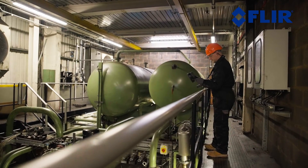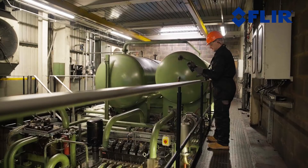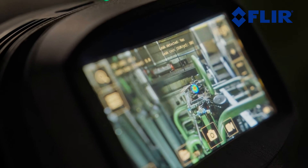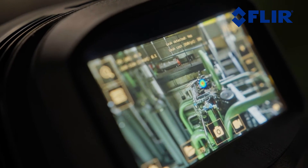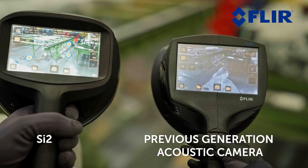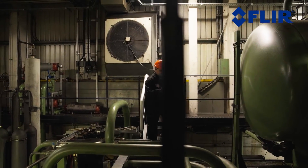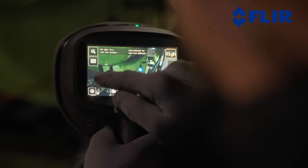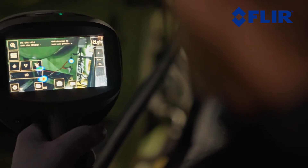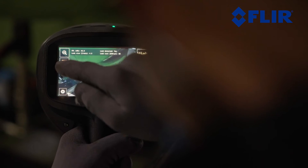You can use the multi-source mode to scan a large area quickly and find several potential leaks. In order to inspect the leaks more closely, switch to single source mode for a detailed inspection of each leak. With the SI2's enhanced multi-source mode, you will be able to detect more sound sources than ever before, including critical issues that would otherwise remain hidden. Note that when using multi-source mode, the device and the thermal studio still only analyze the strongest sound source, indicated by the small crosshair on the screen.